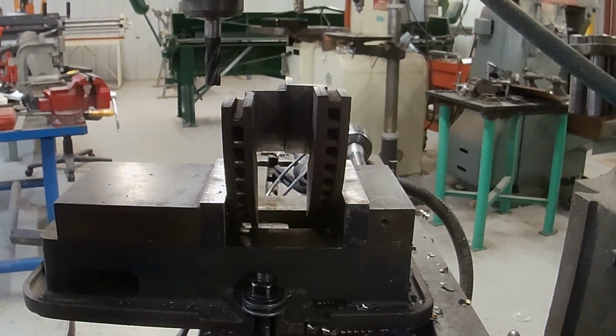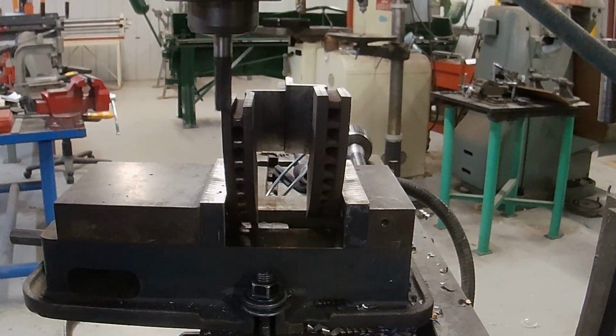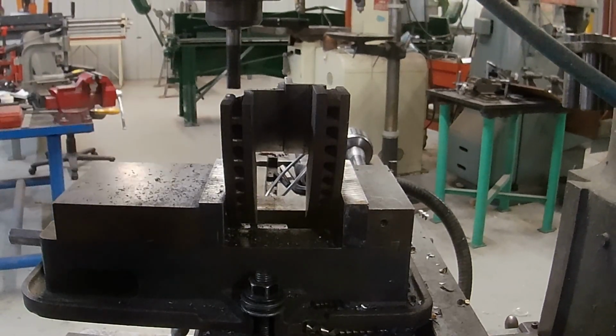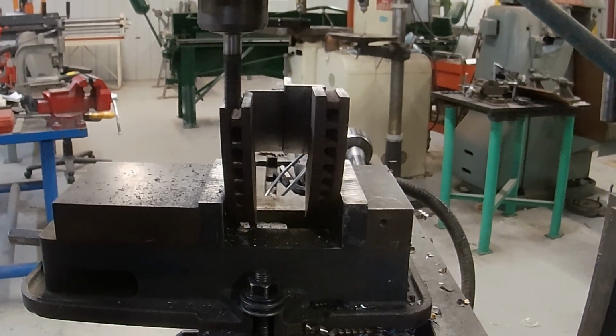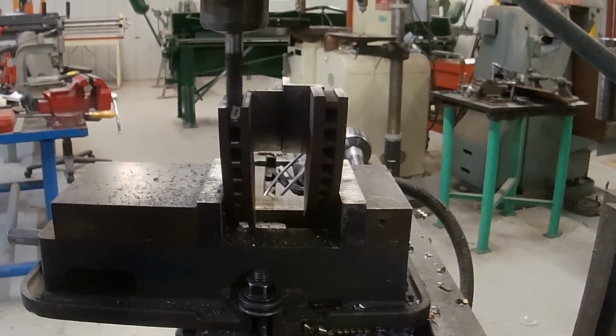I said earlier that this bookstop was made from a brake rotor, but technically this is actually false. It's made from 2 different brake rotors. My next task, therefore, is to flatten both sides. An angle grinder with either a grinding disc or a flap disc would totally work for this, but I'm going to be using the milling machine with a 4-flute roughing end mill, as it will result in a flatter surface.